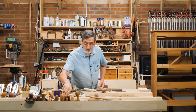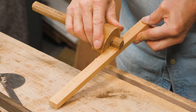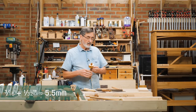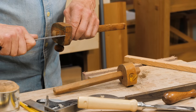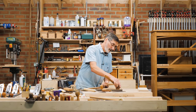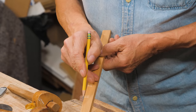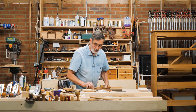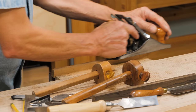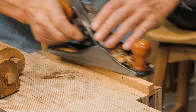Watch what happens now — I'm going to take my marking gauge. I've forgotten the measurement — it's whatever the distance is; I think it's not a dead-on measurement, it's 3/16ths plus a 32nd. And then I've got this one set for 1/8th plus a 32nd — this goes down as well. One is the final cut and this first one is my bevel cut, so I'm using this as a reference for me to plane to. I'm going to plane across the tops of these facets.